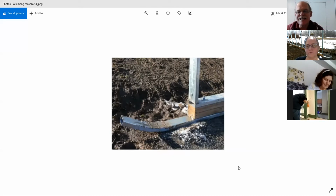You can attach the skis to the bottom of the wooden base without the top rail being welded. It's more of a cost thing. If you're moving the structure a lot, the welded base and top rail do add rigidity to it, but the ski at the bottom will protect the wood from making contact with the soil, and it does slide easier.